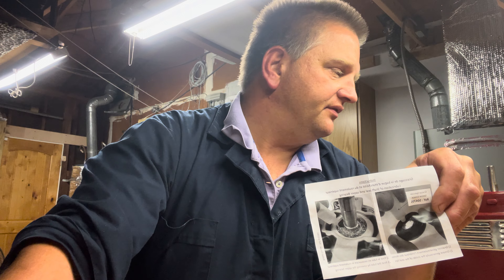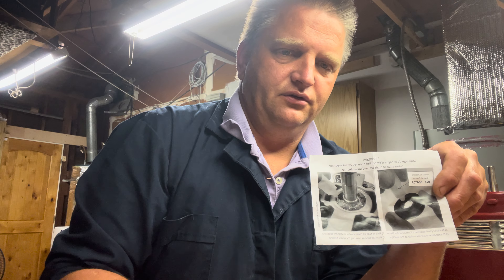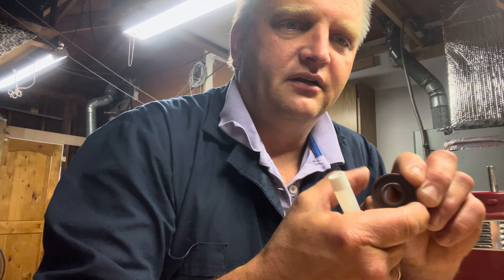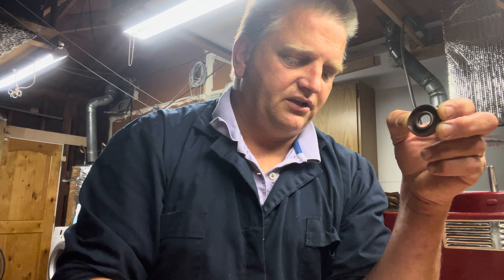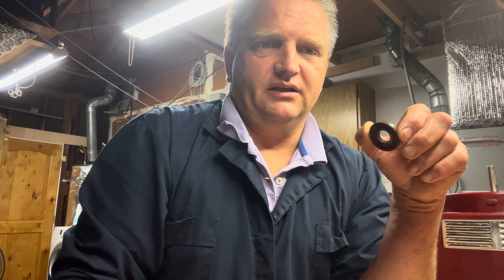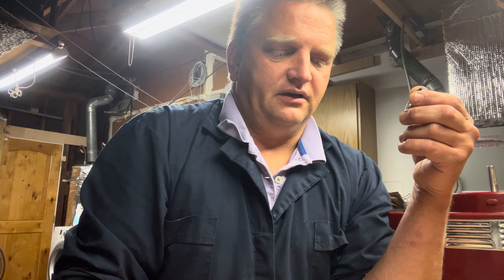In our situation, all you need to do is use some of the silicone grease and squirt it right on the seal itself, all around it. I'd recommend squirting as much as you can inside the shaft as well — that will basically help prevent moisture and debris from seeping through and getting into the motor.